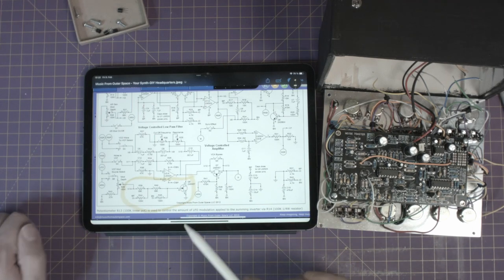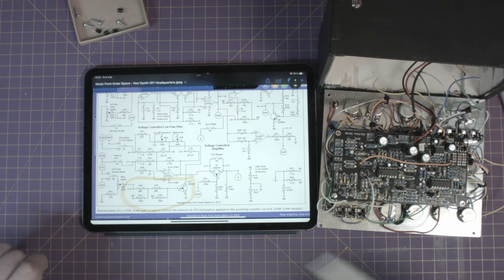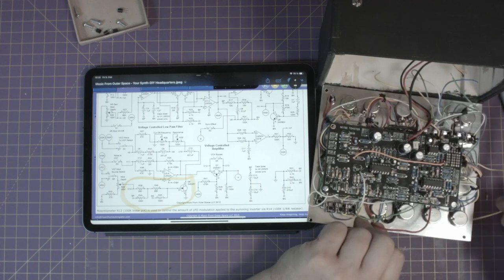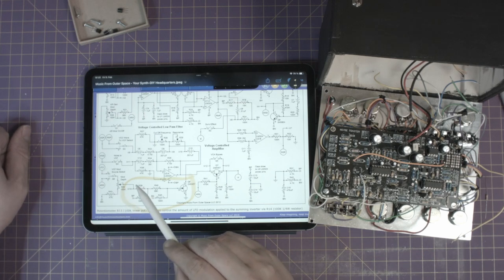Looking at this section of Ray's schematic, we see the components that make up the modulation voltage control. In the previous video, I exchanged this switch for 2 separate jacks so that we could have 2 simultaneous inputs. I've already added the additional jack, potentiometer, and 27K resistor between pin 3 and battery negative to the faceplate. For this video, we're going to focus on these 4 resistors